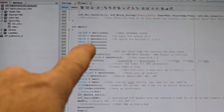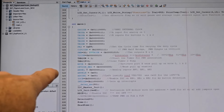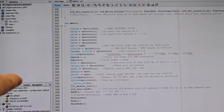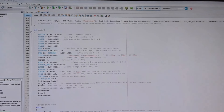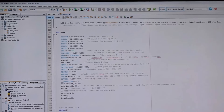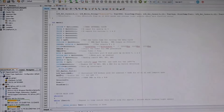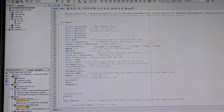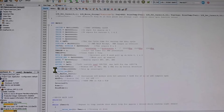I'm going to have to go into the programming. Up here, on Port B, I have bits zero, one, and two set as inputs, and I have the weak pull-ups turned on. Port B on this chip has weak pull-ups built in - they're real weak but they'll do it. So when I turn those on and set those bits as weak pull-ups, those pins are actually pulled up to five volts internally at really high resistance, but it holds it up. That way when you add switches you don't need pull-up resistors. You just got an open switch that grounds those pins, and in your code you just need to remember that when you ground it, the bit changes from a one to zero - the zero is the active state, that's how you know it was pressed.